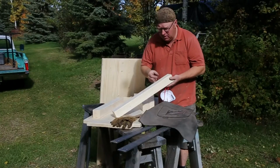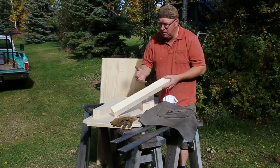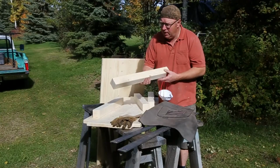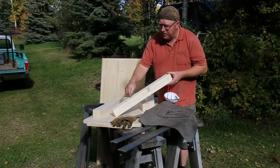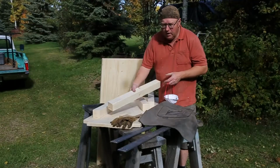The more you sandblast, the more it raises the grain. So you got to kind of decide how old you really want that piece of wood to look. And it's all determined too on the kind of wood you have. This is fairly soft, so it's gonna blast out all that soft material fairly quick. And same with the metal.